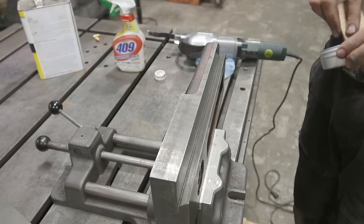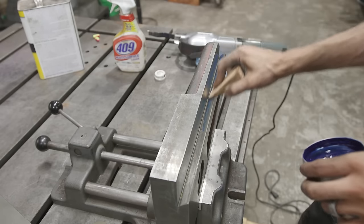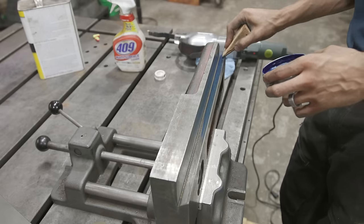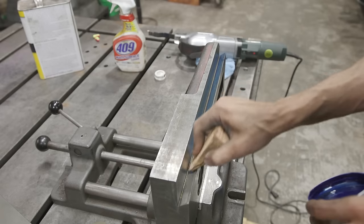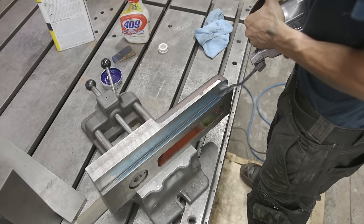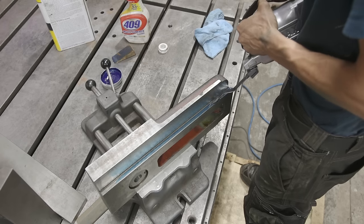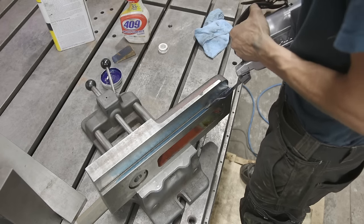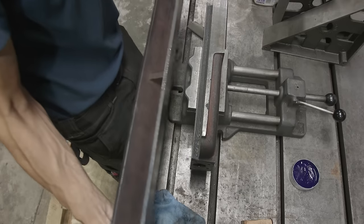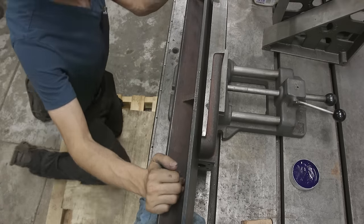That's something really important when it comes to scraping — you do need to have a little bit of doubt when looking at measurements. Stuff can be misleading because you're working with such small measurements, so ideally you need multiple ways to verify so you don't go chasing your tail. I've blued up only 85% of this part. We're going to step scrape up to that line, repeat that process, and keep going until our measurements look good. Then we'll take a more accurate print off the master. With our step scraping out of the way, we're going to do our very first print and see how everything turns out.